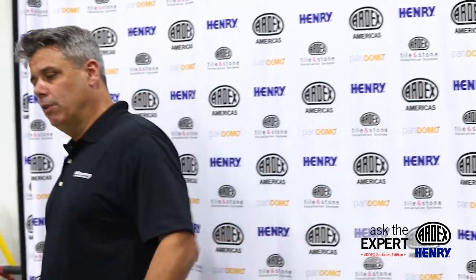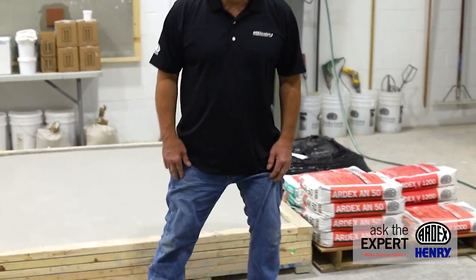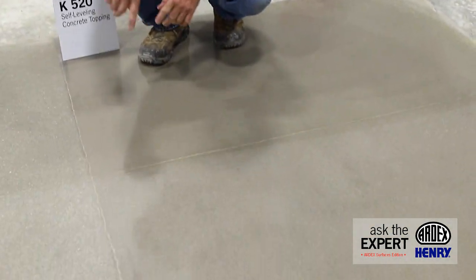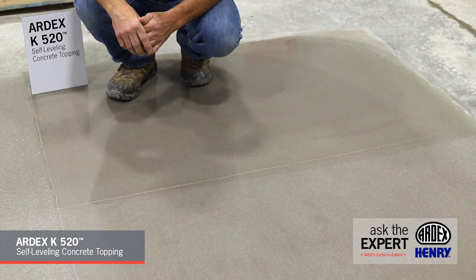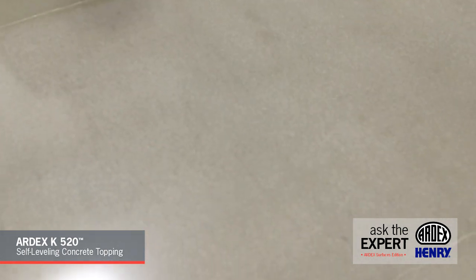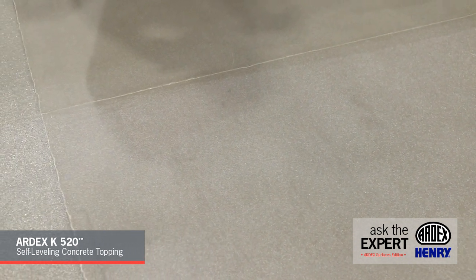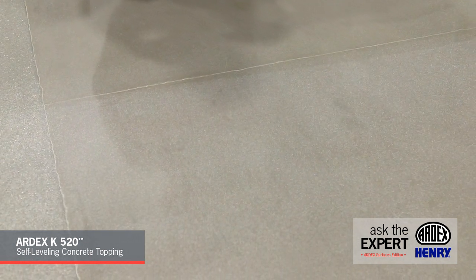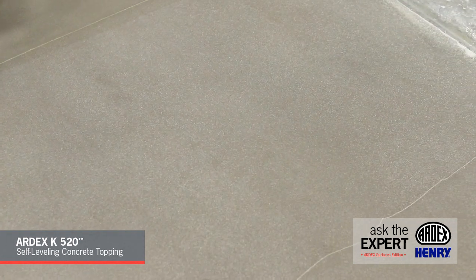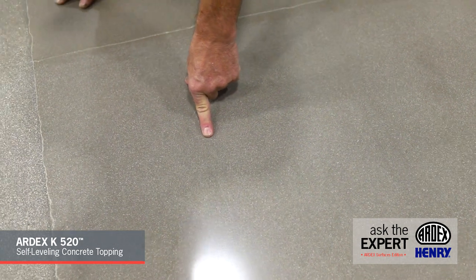We have some material poured out here in our sample area — this is how we actually manufacture our samples, which is why you'll see some hairline cracking throughout. The K-Series was recently introduced to the design community. Right here in this first bay is the Ardex K520. The K520 is a product that can be poured and sealed — we just pour the material down, let it cure 24 hours, and then apply a film-forming sealer over the top. It can also be cut and processed like traditional concrete through a planetary grinder. When you process the K520, you get a nice reveal of a very fine aggregate, a very fine sand, giving it a very unique look.